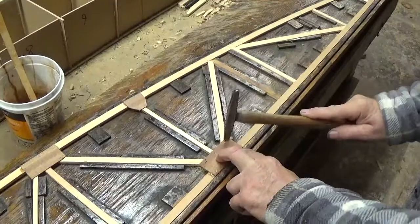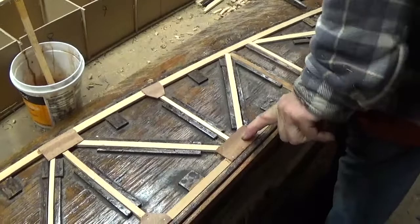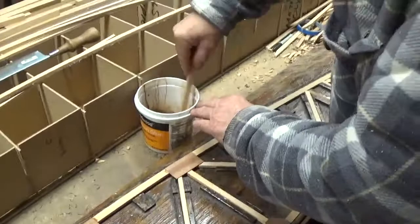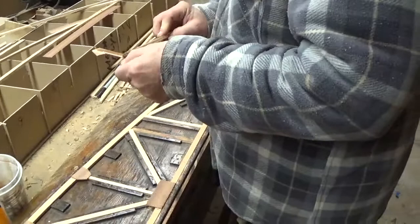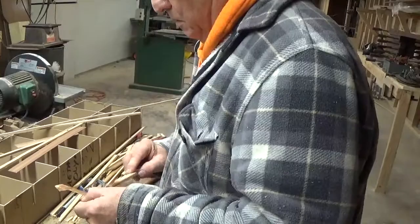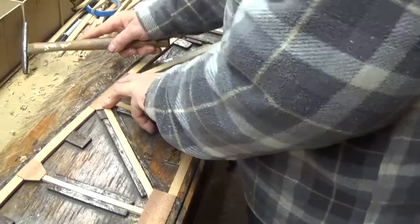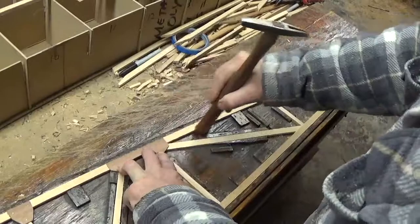Now this rib is for the Ryan M2. There's 28 ribs on it, plus four wingtip ribs, two on each side, which I still have to build a jig for. This is actually the last long rib that I'm building for this airplane. And a couple center section ribs at the end here where I'm working now is different. It actually curves down like this to meet up with the center section.